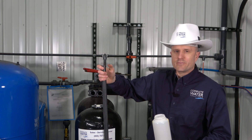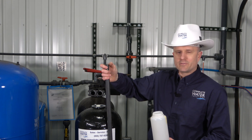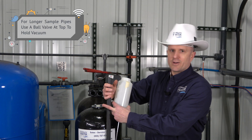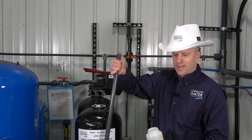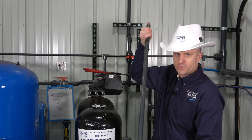If you have a really big softener tank, my recommendation is to put a ball valve at the top of the pipe. This way you can get it into your bed, valve it off, and then pull it out. Here today, I'm just going to use my thumb, cover it, pull it out, and then extract the resin into the jar.